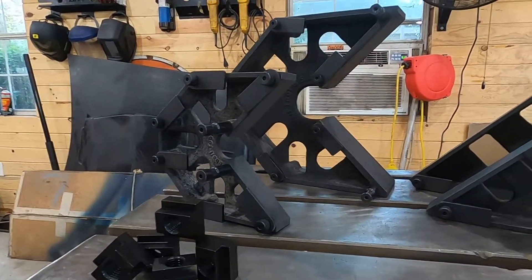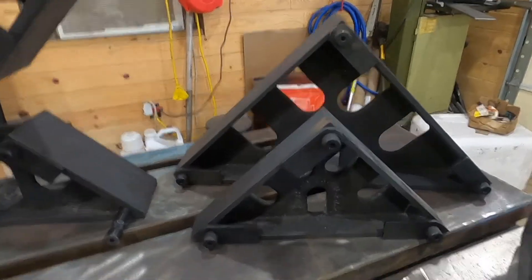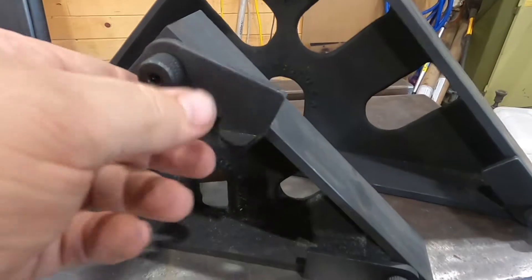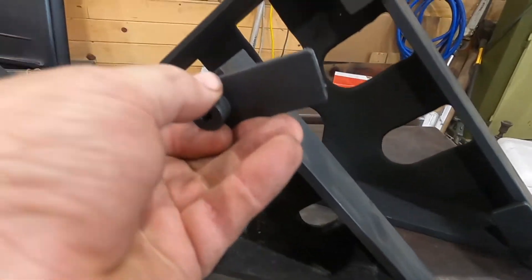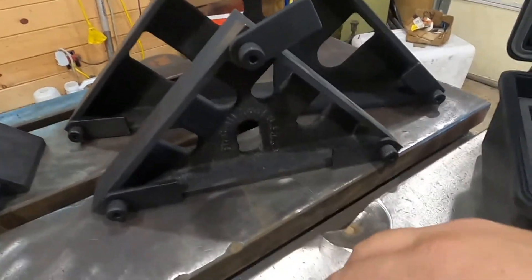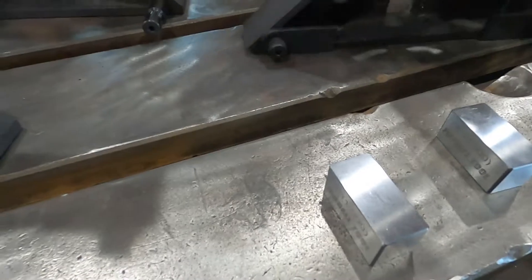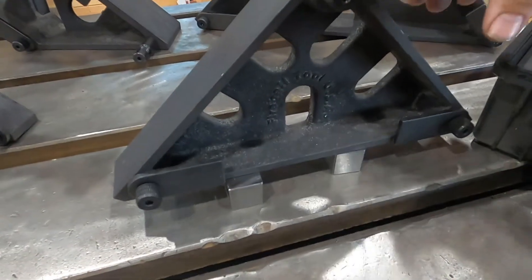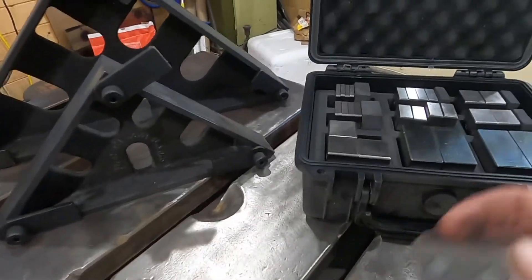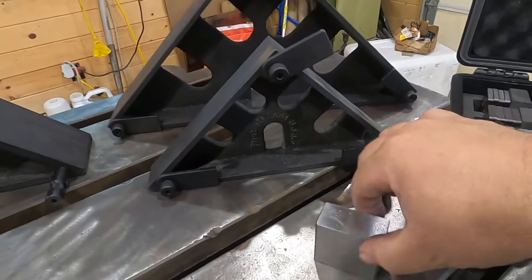What I'm showing you here is Fireball Tools makes these squares — that's the monster square and the regular square. I got the cast iron version and the black oxide coating. They've got these pretty cool little tabs that can fold over, just help square everything up, hold it all the same. This is not a sponsored video — I bought these from Fireball Tools just like everybody else. It's basically like 1-2-3 blocks but they're for fabricating. They're magnetic, and you can use them to hold stock up at different heights for welding and stuff. I find I use them quite a bit — just a set of magnetic blocks in different sizes and thicknesses, works out pretty good for squaring up stuff.